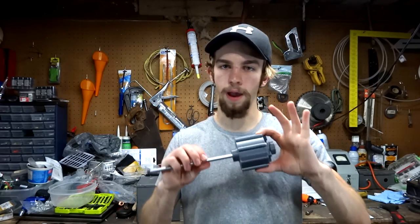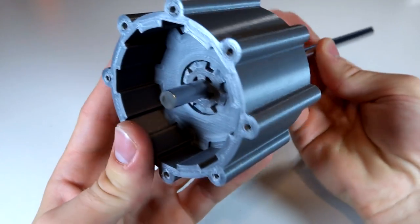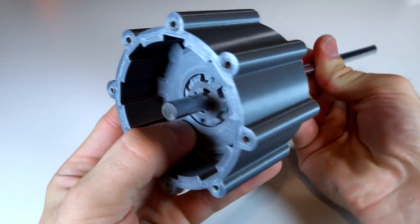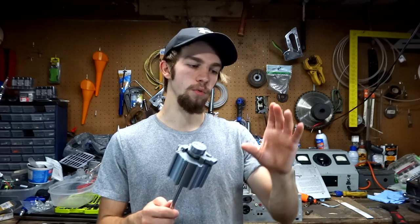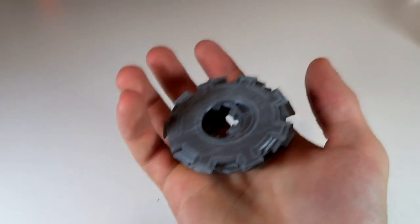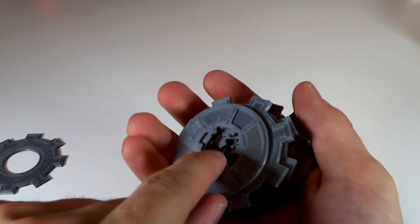What I made is called a clutch pack. This has multiple clutches inside instead of one. As you can see there's plenty of slippage, but when I start applying friction it's harder and harder until I just don't have enough grip, because when you have all these discs pressing together it actually creates a very large amount of surface area across multiple discs rather than having one very big disc.